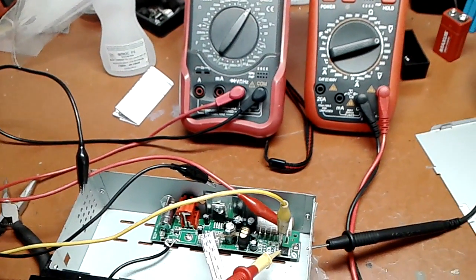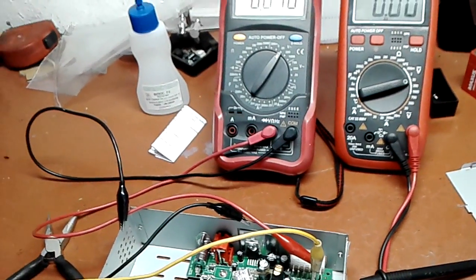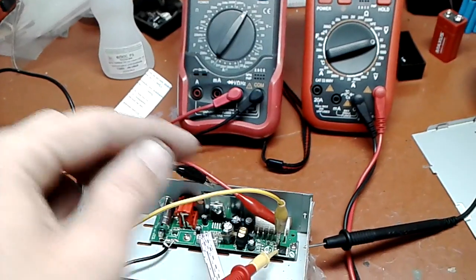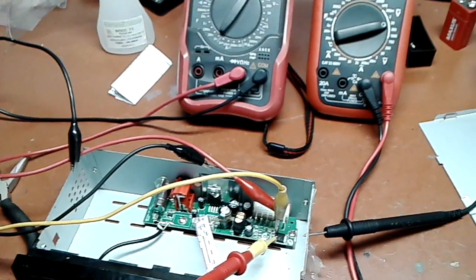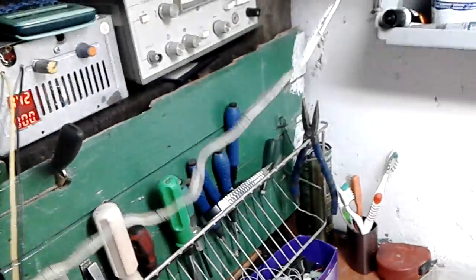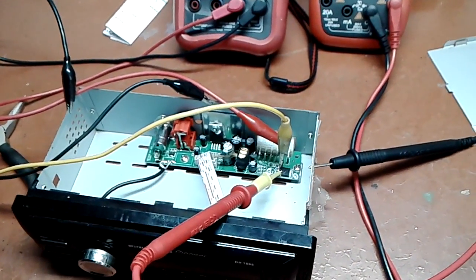And the other 4.7 ohm resistor, I guess, is there to dissipate some power on itself, maybe. It's a linear regulator, so you can dissipate the power somewhere else, like on the resistor which is on the input of that regulator. But I'm not entirely sure why they did that, but whatever. So I'm gonna do just that. Then I'm gonna try to power it up, test each and every channel, and then hook an antenna to it, this lovely piece of wire, and we will see is it working or not.